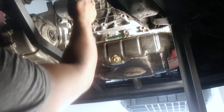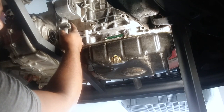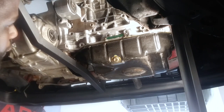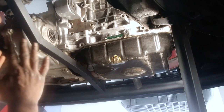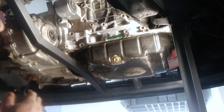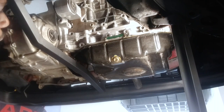As you can see I only have two bolts holding it in place right now. What I plan on doing is getting a piece of angle iron and coming from here with a bracket — it's going to go up to this side and then I'm going to put a bolt into that side. So we're going to have three bolts holding it in place, which should be more than enough. This mount doesn't really support the engine's weight — it just stops the engine from moving back and forth.